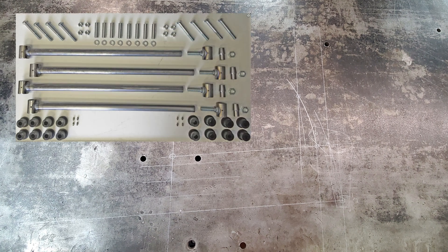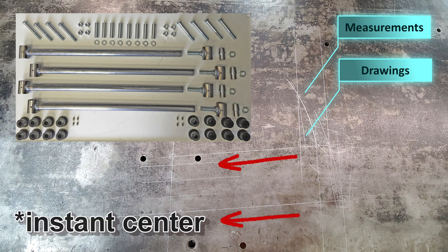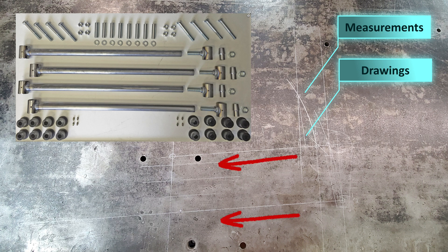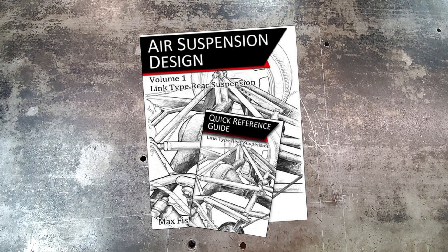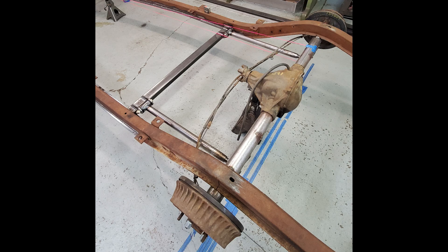After modifying the frame it was time to get on with the rear suspension. I am using a universal 4-link kit to make a triangulated 4-link setup. I started by taking lots of measurements and making a few drawings, along with considerations such as roll center and the amount of floor pan that would need to be cut out for the upper triangulated links. I purchased and read Max Fish's Air Suspension Design Volume 1 and it has been extremely helpful throughout the process — I highly recommend it. First I sketched on my welding table to calculate the roll center and picture how the movement of the rear axle and suspension would be throughout the travel. Next I built a cross member out of some rectangle tubing that the lower links will mount to.